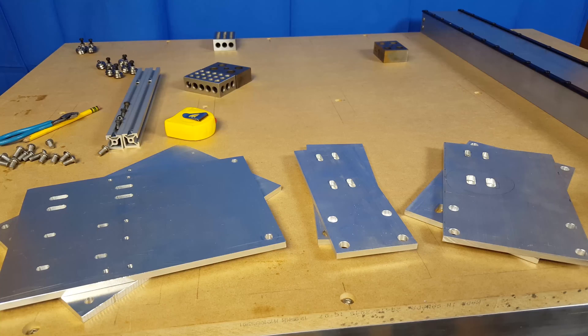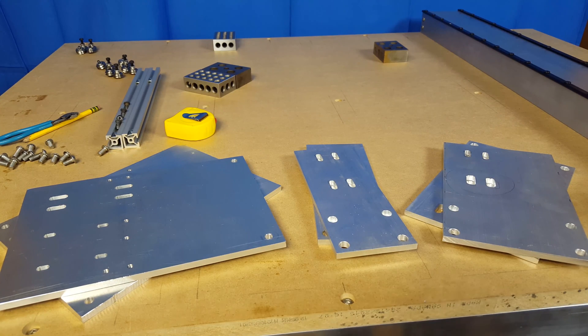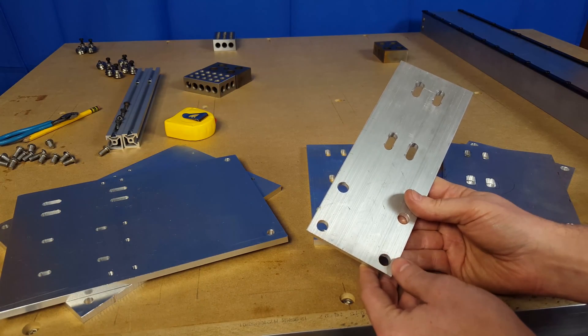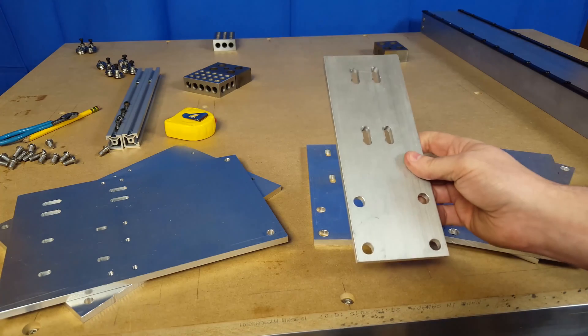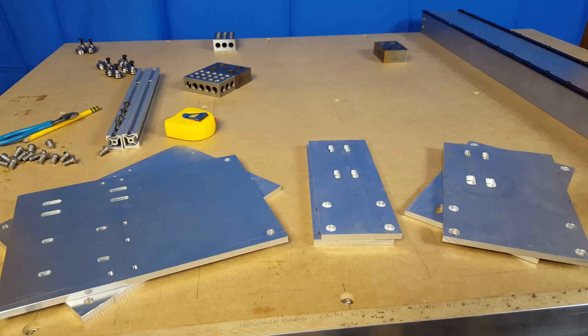So I want to get rid of that to get the maximum travel on the Y-axis. All the footage I made today while I was working out in the garage is somehow gone, so I guess we'll just talk about what I did. It's not that big of a loss because I really didn't do that much. Essentially I squared up the Y-axis plates — they had one side that wasn't really square with the rest — so I milled that and it turned out just fine. I also put these all in the drill press and drilled out those holes on the bottom a little bit bigger because they'll be mounting to the table and I wanted a little bit more up-down adjustability.